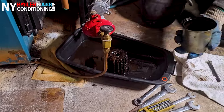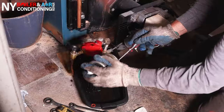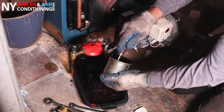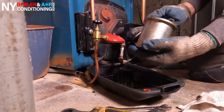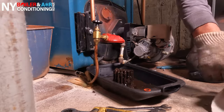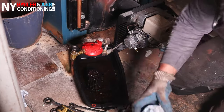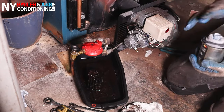Whenever you're dealing with oil, it's highly recommended that whenever you have an oil boiler in your home, you don't want to let the tank go dry. Why? Because this is an oil burner — it's a pump that sucks fuel and burns it. It doesn't know if it's water in the tank or anything else. It just knows how to suck. Whenever the oil is very low, it starts sucking up all the sludge from the bottom of the tank.